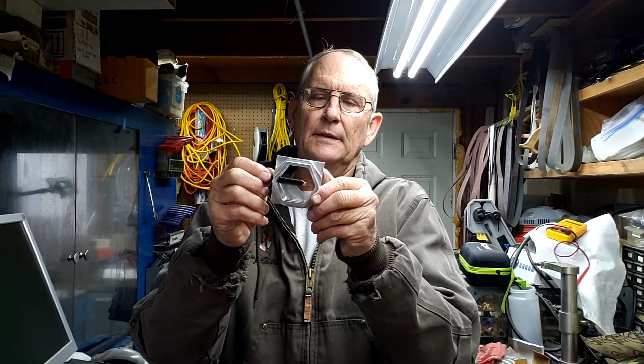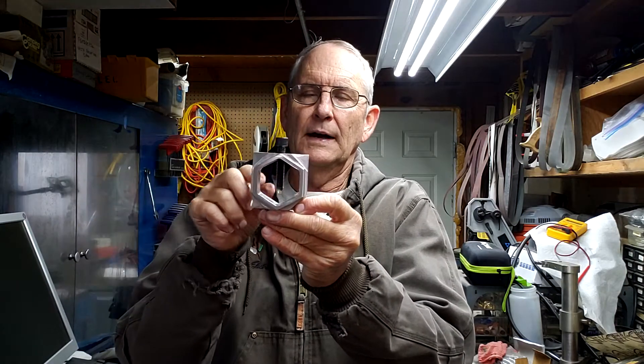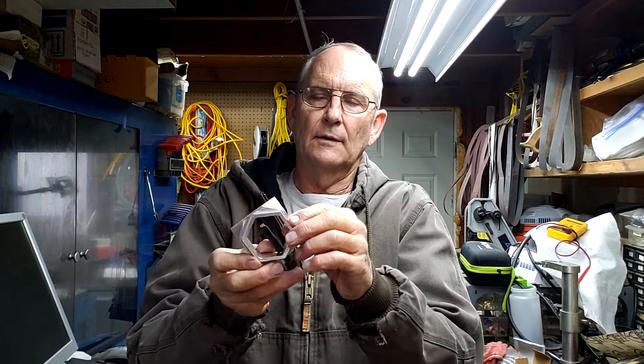In this video I'm going to show how I made this device. It's called a rose index — the company that sells it calls it a rose index. I just made one for myself. There are a couple websites that show how it's used; recently Mr. Pete showed how to use one. You can put a round tube into the vise, clamp it down, square it to the machine table, and rotate it one-sixth of the way on the hexagon, one-eighth on the octagon, or a quarter on the square — a quick and dirty way to grab something if you can't use a 5C collet or an index plate.